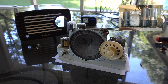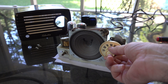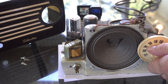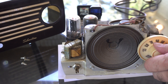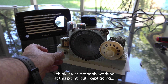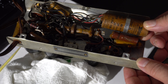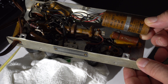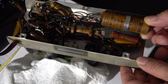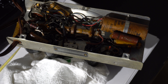I can hear something. Let's see if we can get a station. Seems like the amplifier is working but the radio part's not. Rosanna watched one of the expert videos and one of the things he did was replace this — it's an electrolytic, a three-part filter capacitor. It's got a 40, a 20, and a 20, and he replaced that with a 47 and two 33 microfarad capacitors.